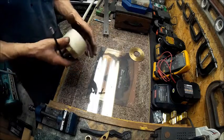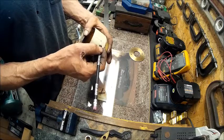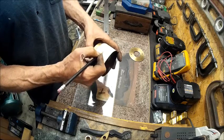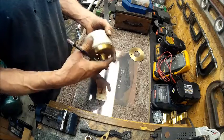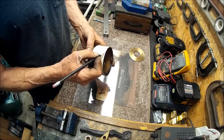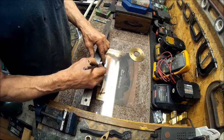We already know where the centers are simply because the hole for the switch and the hole for the reversing switch are straight across from each other. I've drawn the line right there and another line here. These are across from each other so I've drawn lines accordingly. Now we're going to try to find center — we're just going to eyeball it, not trying to get it perfect. It's two and a half inches, so one and a quarter to center.